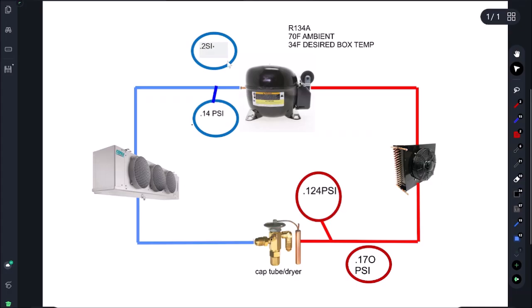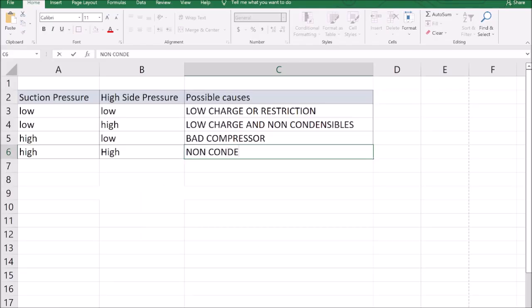The last symptom: high and high — let's say 135 psi suction and 170 psi high side. When we have high and high, it means we have non-condensibles in the system, meaning the refrigerant is no longer any good. This can happen from a previous tech not following proper procedures — not pulling a proper vacuum or leaving nitrogen in — but the most common reason is a plugged condenser causing the refrigerant to overheat and essentially turn to sludge. If the condenser is now clean but pressures are still high and high, we have non-condensibles.